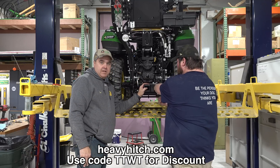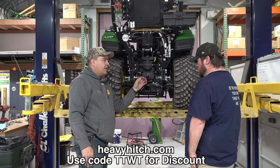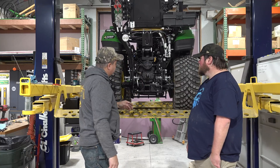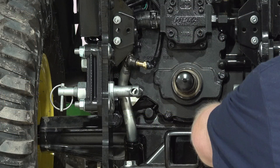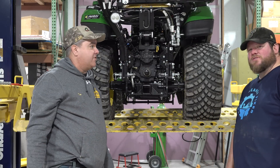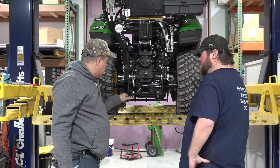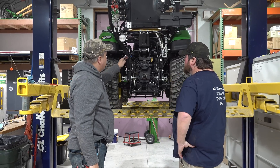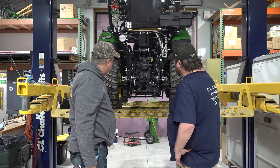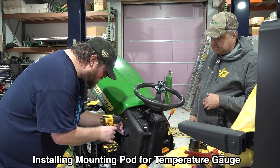What's great about the 2-inch receiver is you can put either a standard drawbar or a ball hitch in it. They've also got one with a hook that still fits with the backhoe and all the PTO covering. The torque spec on those bolts is pretty high — like 223 foot-pounds or something — though it's unclear exactly why it needs to be that high, possibly because of the ROPS. During installation, the drilling needs to be slow and gentle so you don't drill into the ICC, and the screw that holds it in will self-thread the hole slightly.